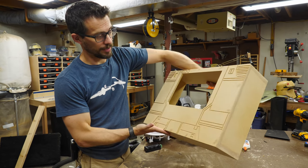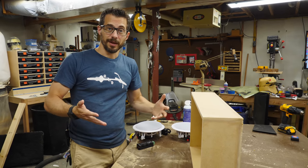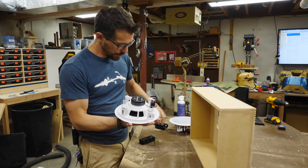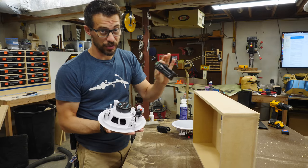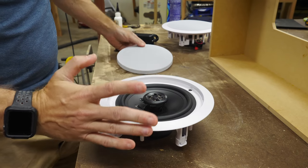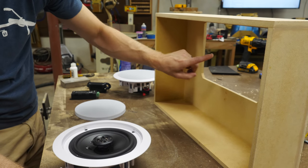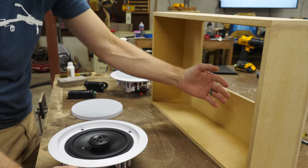I've got this thing all sanded up and it's finally starting to look like a boom box, which is really cool. The next step is mounting the speakers on the inside. You could get a DIY Bluetooth speaker kit, but I found these speakers on Amazon — they're actually made to be mounted in a ceiling. They're just normal speakers, but they come with a Bluetooth controller. You just wire the speakers right to the controller, add power, and you're good to go. Since they're made for ceilings they're white, but I'm going to take out the grate and paint them black so they blend in on the inside of the box.